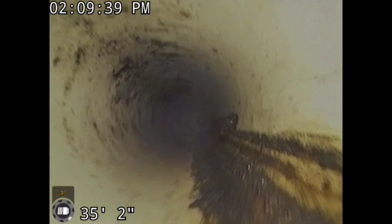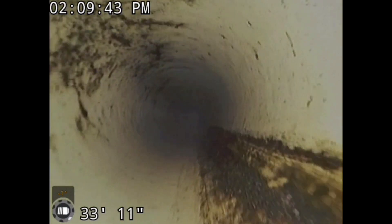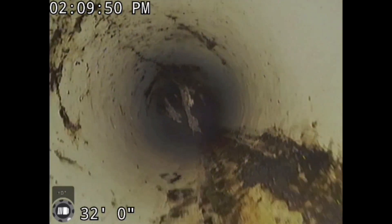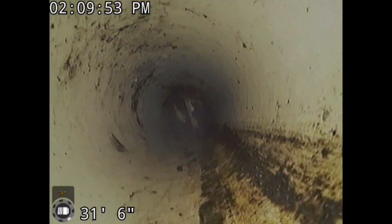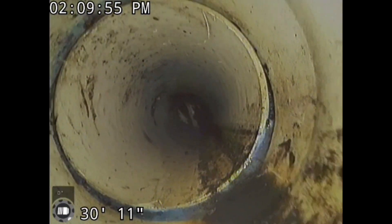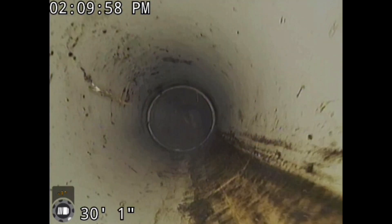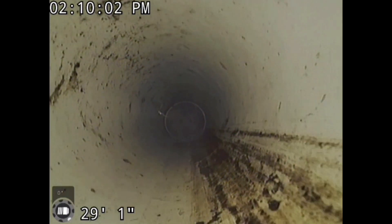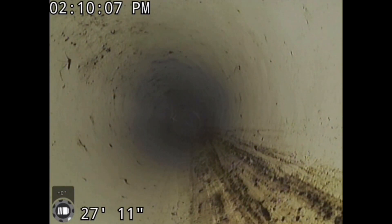A lot of mold and mildew in this system. A French drain system that doesn't vent at the top is going to do the same thing. So this was a great opportunity for me to bring up and show a couple of things. We're starting to come back to 1% slope here. You can see that there was some shingle gravel lost — a little bit of debris as it was going from 1% to 2.5%. But we're clean here. Everything is the way it's supposed to be.